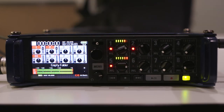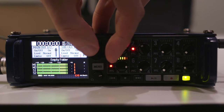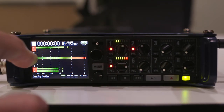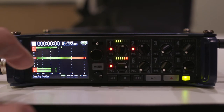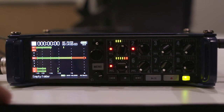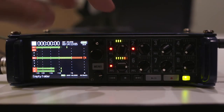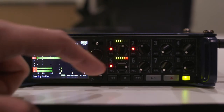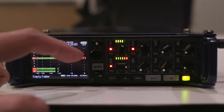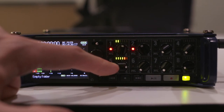Another feature of the Zoom F8 is its dual record ability. Using the jog wheel, you can scroll into other menu systems. You'll see an overview of Channel 1's recording, and D1 is a replica of Channel 1 set to dual record. Channels 1 and 5 are matched together, signified by the red LEDs — they work in vertical-sequential pairs, so 1 is paired to 5. Currently the fader on Channel 5 is set higher than Channel 1, so on the VU meter D1 is peaking.